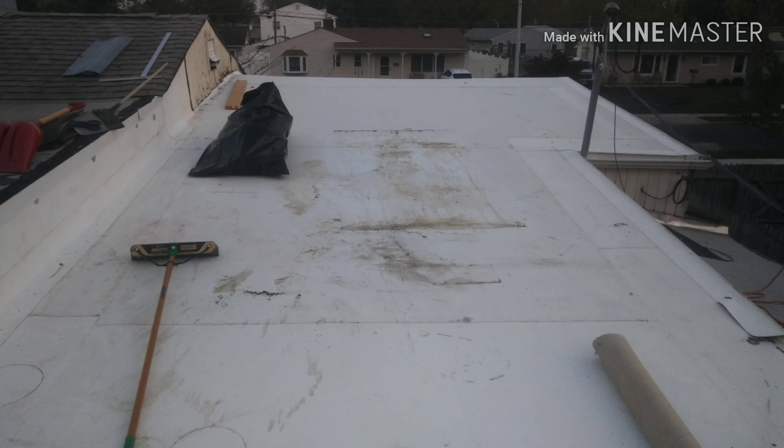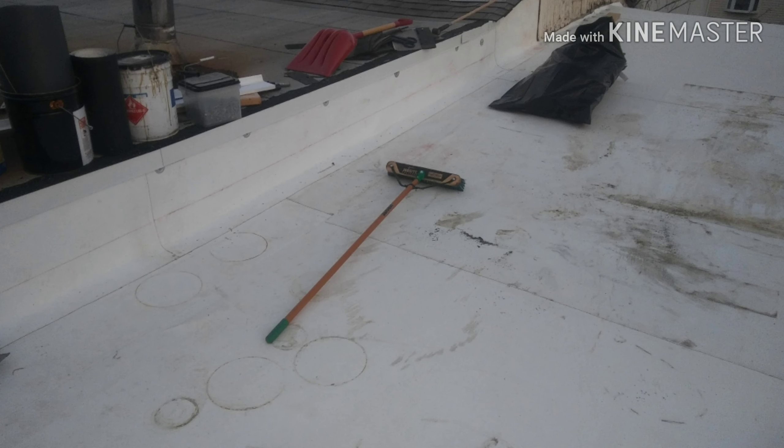Here's one of the final results, prior to my cleanup — I still had a little bit of work to do on the perimeter. On the right-hand side it looks like a six-inch strip. I used a 10-square roll, which is 10 feet high by 100 feet long — this minimized my seams. The roof is roughly 33 feet high and 13 to 14 feet wide. I put new drip edge on it, screwed and plated it, welded it, tucked that material up the side wall, and put a cover tape over the drip edge. One side of that has a sticky membrane that you prime with an adhesive, roll it, and then weld one edge to the TPO. Here it is going up the wall — I think it turned out beautiful.